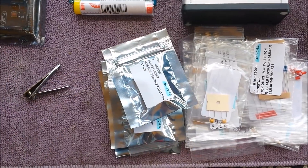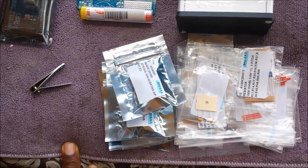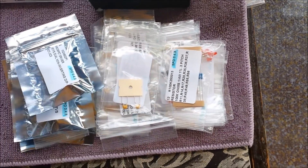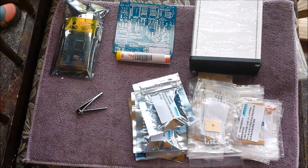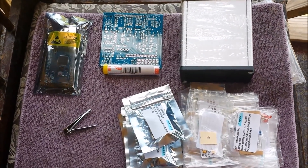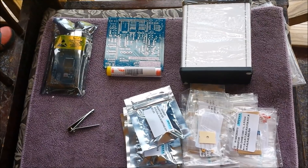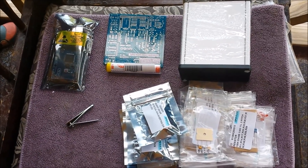Pretty well packed package — everything is labeled and shows you pretty much exactly where everything is going. On this one we have resistors and it gives you the value of the resistors and where exactly they go — capacitors, map sensors and so on. The Speeduino site gives you a brief description as to how to go about it. It's a pretty good guide; you don't have to follow it in the exact steps but you should since it covers the easiest route. Some components may be a bit more difficult than others, but in the end you just solder in components, double check everything, and it's a pretty easy task.